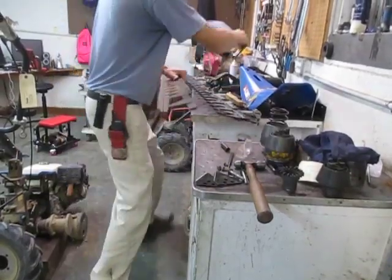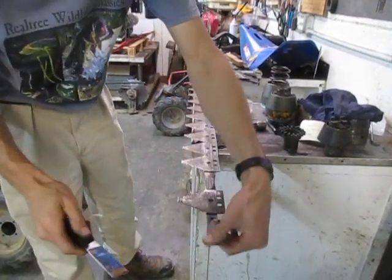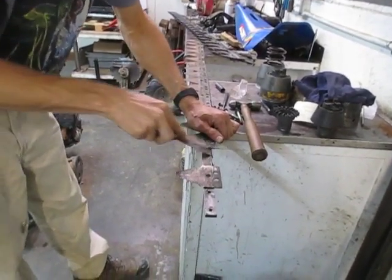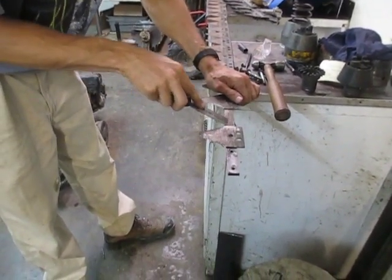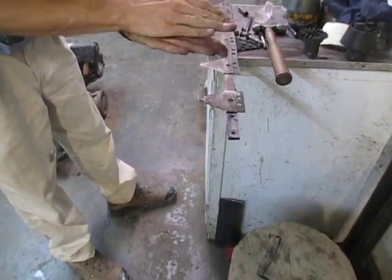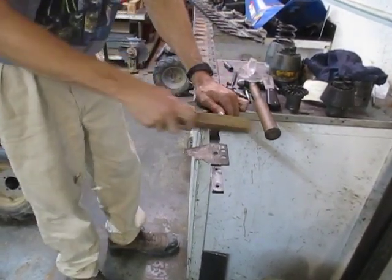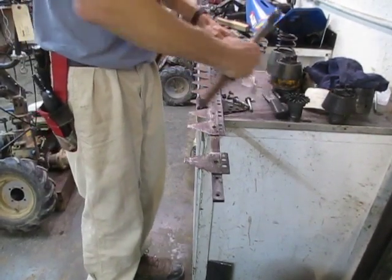Next, grab a wire brush and clean off the bottom of these teeth a little bit so when we put it back on the main body against the lower teeth we don't have any grass stuck in there messing up our surface contact. Scrape off where the new teeth need to go - where a tooth has been missing a while there can be built-up grass. If you just slap a new tooth right on there and rivet it in place, you'd be trapping that grass between there, and that tooth won't stay tight very long because you'd be tightening surfaces down against grass which would work its way out.